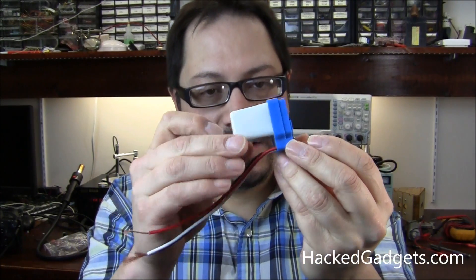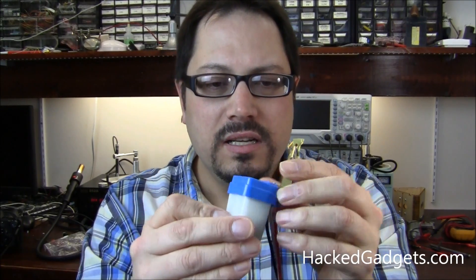I can't see any electronics in here — it's too opaque for that. But I'm thinking for that price there can't be a relay in here, though a relay would be the obvious choice. If this thing was only DC, I'd say there's probably a MOSFET in there to handle the switching. But it's AC and DC — if it was just AC, I'd say there's probably a TRIAC handling the switching. But how do they do AC and DC without using a relay? I can't think of any very inexpensive way, so I'm thinking there must be a relay in here.